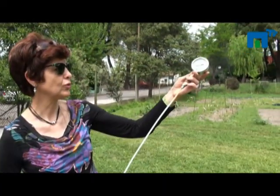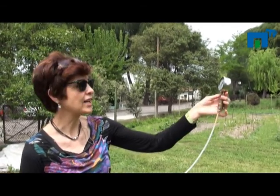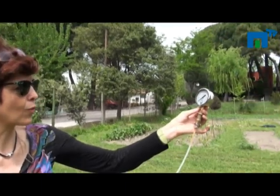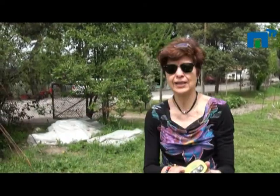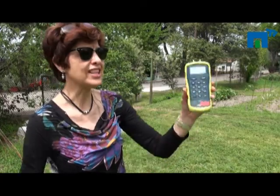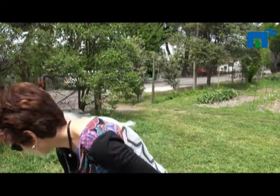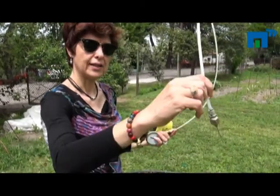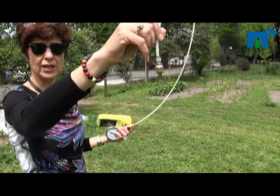What should be the optimum discharge for the emitter? In the market you can find from one liter per hour to eight or ten liters per hour — a wide interval range. When dealing with pressure, don't forget to install a pressure gauge at the beginning of the irrigation unit. You can leave it fixed there and check the pressure at any time, or use a pressure button with a digital manometer: punch it into the outlet and measure the pressure.